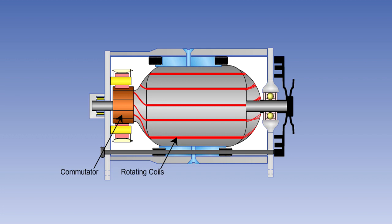In practical electric motors, several coils are wound on a single rotating core, with all the coils lying at different angles to one another. With this arrangement, the turning force acting on the rotating assembly will be more consistent and efficient. The magnetic field produced by the stationary magnet is known as the field of the motor, and the assembly around which the rotating coils are wrapped is called the armature. The armature has a soft iron core to increase the strength of the magnetic fields of the coils.